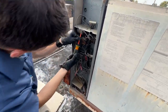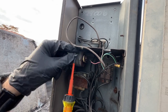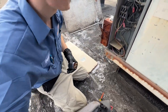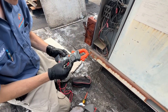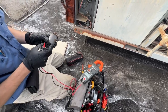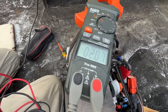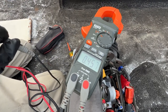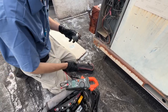We're going to make sure the capacitor is good so we don't put any more wear and tear on the blower motor if it's out of range. The wiring was already disconnected. We set our meter for microfarads — it automatically adjusts. This one's rated for 15. Going from one lead to the other — it reads 14.47, so our 15 microfarad capacitor is actually good.